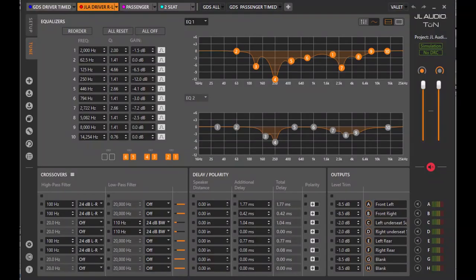The VXI also has a digital optical output that can be routed through the equalization blocks — so you can apply EQ to the optical output, it's not just a pass-through. This is most beneficial when using multiple amplifiers networked together. Your analog source comes into the master amp, and then the optical out feeds into a network hub, which allows communication of all the amplifiers together for things like preset switching and volume control. That optical output is then distributed to all the other amps, avoiding the additional latency you'd get from daisy-chaining them through each other.